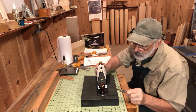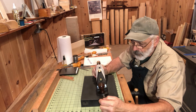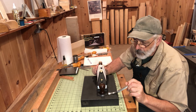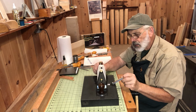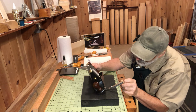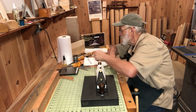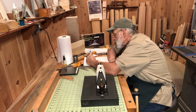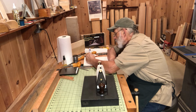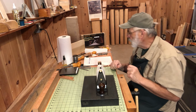1 1/2 thousandth under the knob. And it goes all the way under and slides right out. But nowhere else. See, I can pull it. It begins right from the mouth forward. So flatness minus 1.5 thousandth in the front under toe. And we'll find out why as we look into this further.